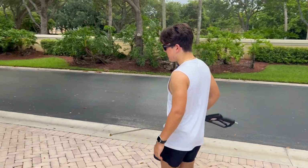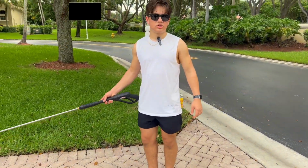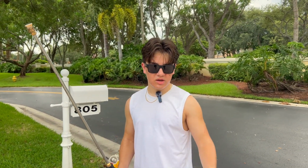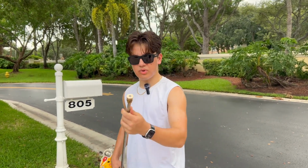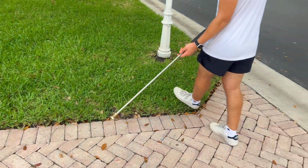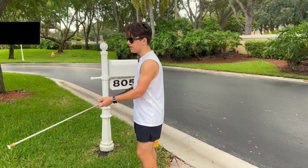Generally, if you come over here to the sides or the edges of the driveway, the surface cleaner, unless you run it on the grass for some reason, like a lawnmower, probably doesn't hit the edges as much. So that's what you want to do in this rinsing step: along with getting all the water drained, you also want to make sure that you hit the edges with the pressure washing gun. So let me demonstrate really quick. Go in closely. You could try this from different angles because it depends on the environment.